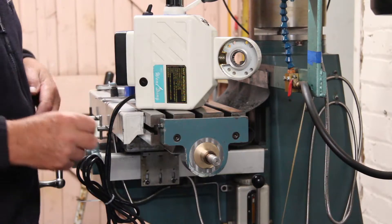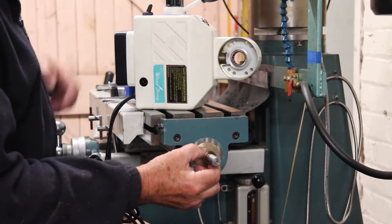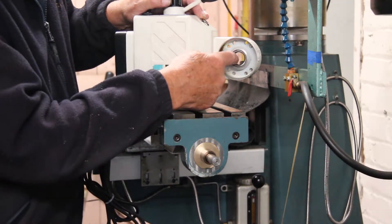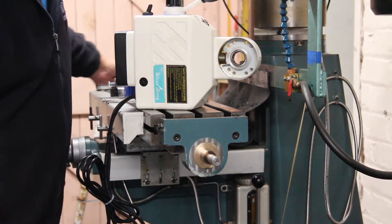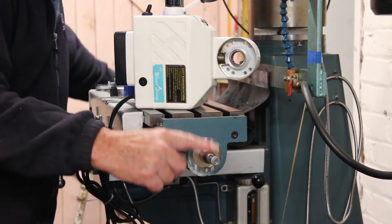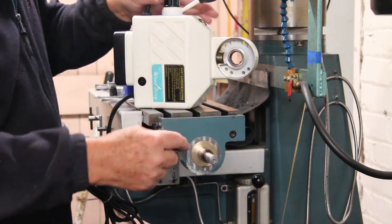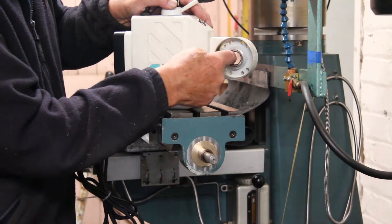The reason we have to do that is because we want this bushing to revolve inside the needle roller bearing here. There it goes — it revolves with the shaft, so that when we put this on here, it's revolving in a decent fit in the needle roller bearing.